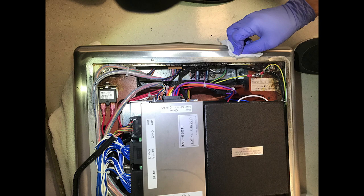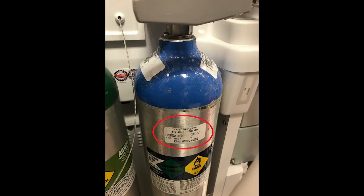Do a complete check after self-repairs. You are fallible. Remember that physical damages usually have obvious and not-so-obvious problems. If a case is cracked and a touchscreen needs repaired, perhaps the power transformer also broke loose on the power supply or the motherboard. Do a complete opened-up visual inspection and a full function and calibration check when there are signs of rough use. Staff are very suspicious of any device that comes back from repair, and even little issues will be treated like an emergency if there's a callback.